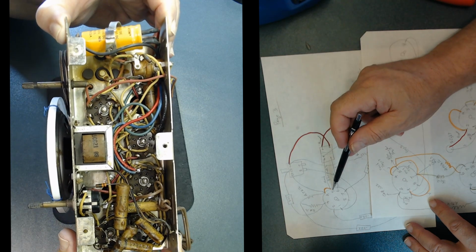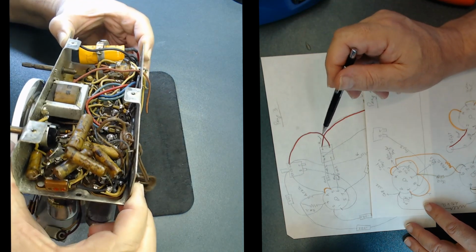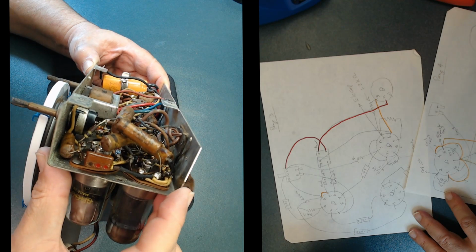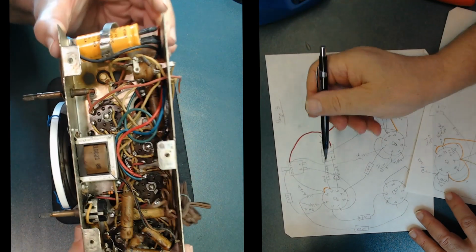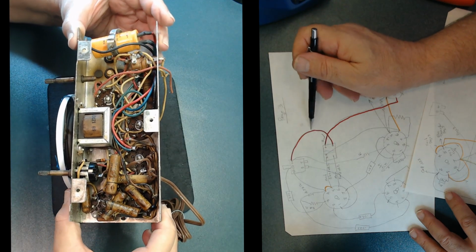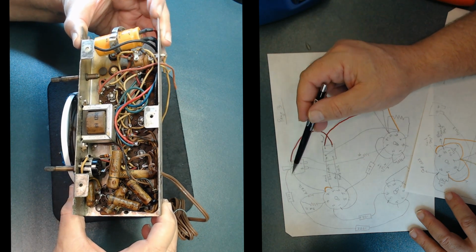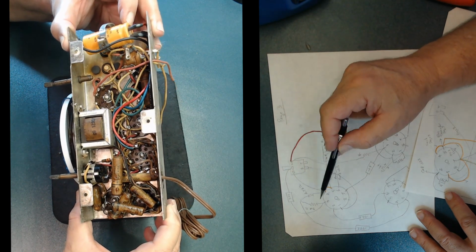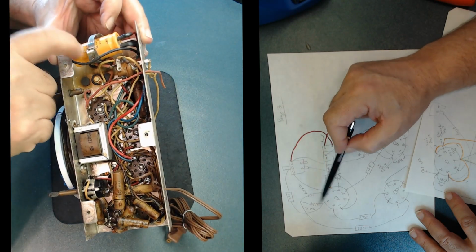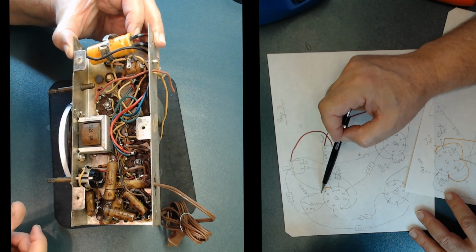So what I'm going to do is look under the chassis, at the tube layout. I'm going to draw this on 5 different pages. Then as soon as I remove one part, I'm going to document it on the proper page, so later on it will be easier to install. What I'm trying to accomplish, look at it like layers of removal. What should I remove first? What's next, until I'm able to get to the wires and remove those, and then work backwards. Hopefully this makes sense.